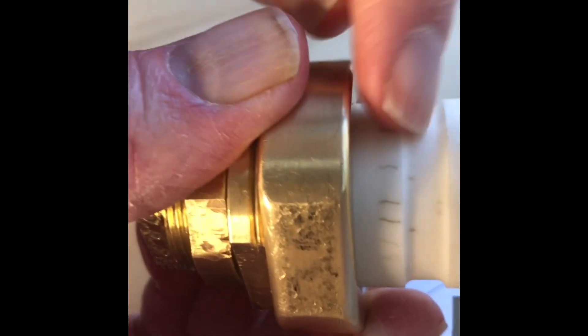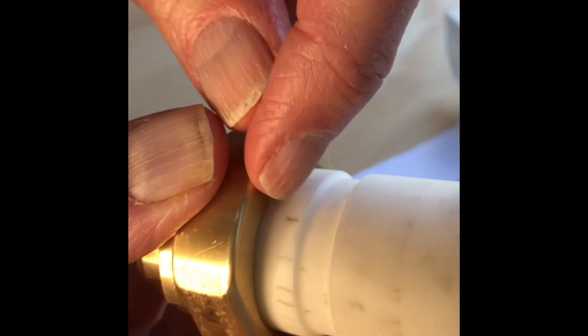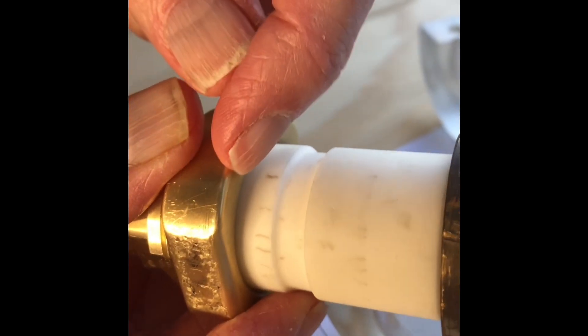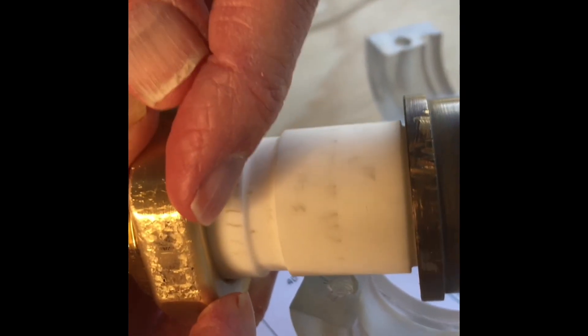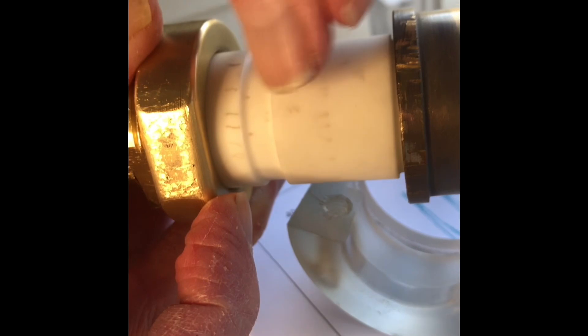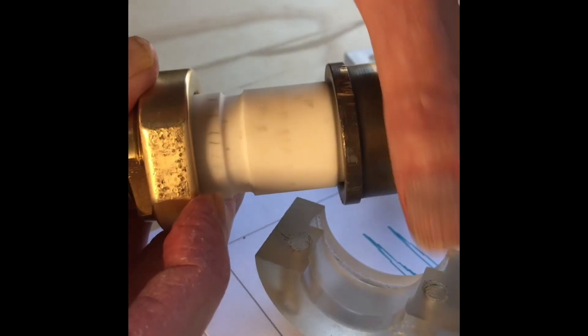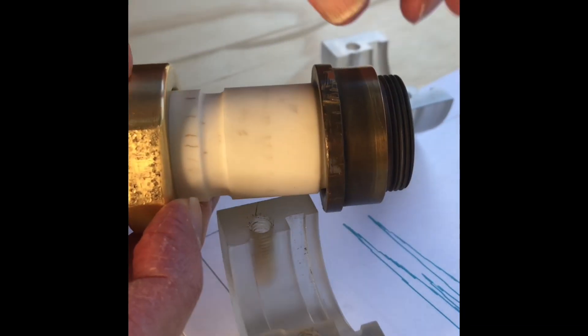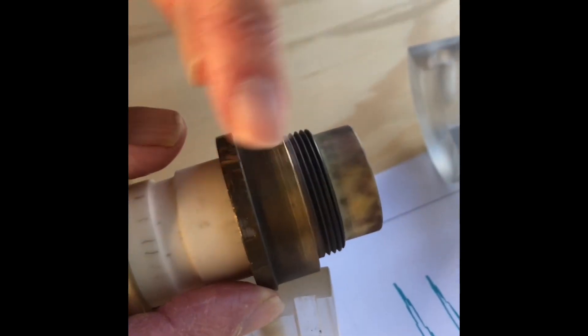Can we see these little marks here? These are clearly arcing marks and the arc extends. The reason it doesn't extend all the way back here is because we had a rubber guard, which was supposed to protect against arcing but wasn't doing its job. And the arc extends along the rubber to the ceramic, goes underneath the Lexan, and then arrives at the base where it can travel directly to the anode.